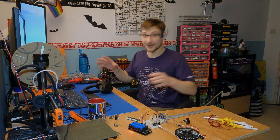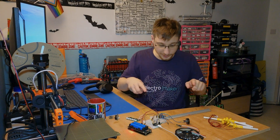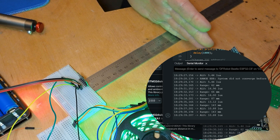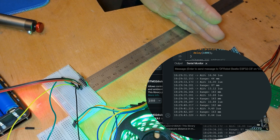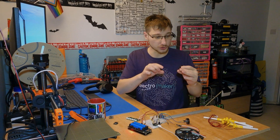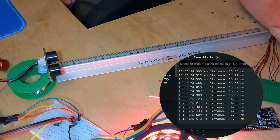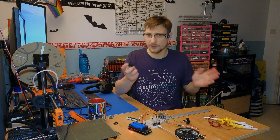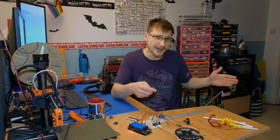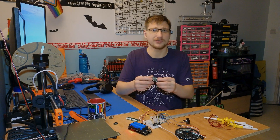It's been a couple of hours. I'm very tired, it's very late. But I have something I'm very happy with — quick recap. I tried using a time of flight distance sensor, which works great, very accurate, but it has a very short detection range, so it won't work here because I need meters. I tried using the ultrasonic distance sensor from DFRobot — specifically the analog variant — but it just does not work the way it should. When I set it here, it thinks 30 centimeters is like 17, and it doesn't really want to detect beyond that. And then when I get in closer, it just gives very confusing readings. So yeah, it's another loss for DFRobot.